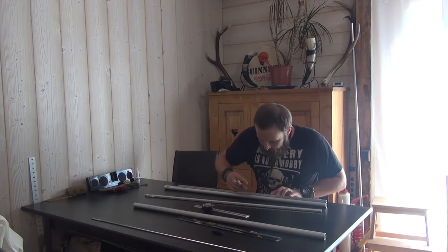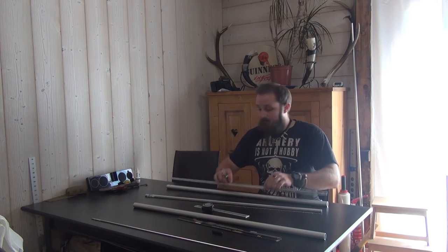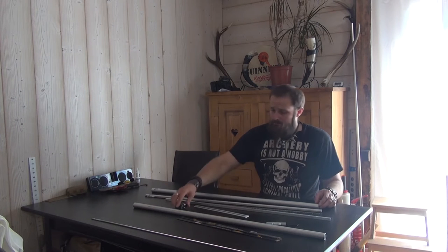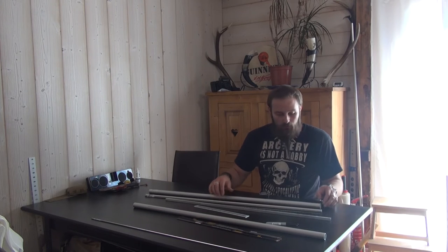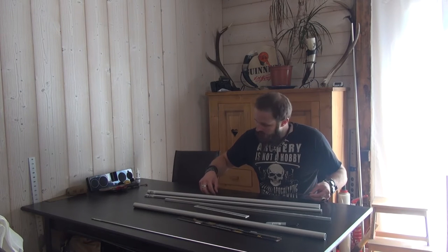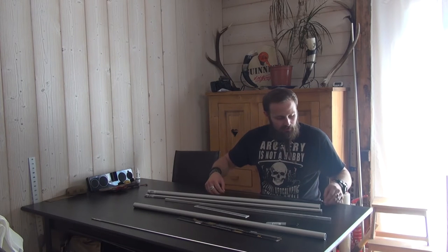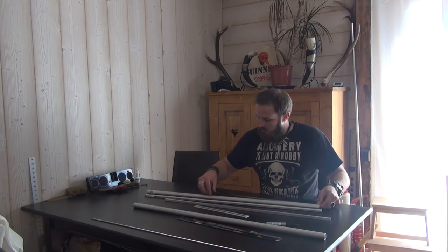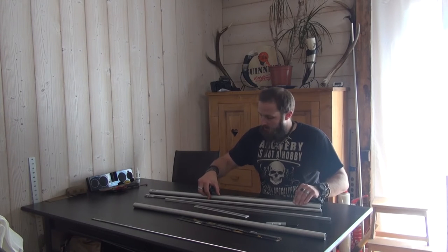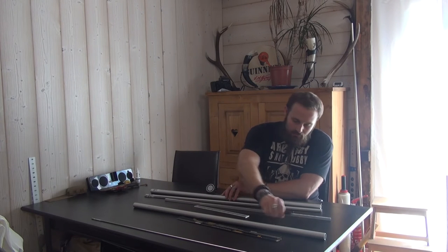You will see, it's not a very long thing to do. Last one I did, like 17 minutes to build it, and I will of course shorten the video to only the most important parts. Now the holes. Now that I have my center line, what I want to know is what is the length of the saw blade. Here it's 53 centimeters, so my end piece will be at least that. I will probably make it just 54 centimeters long, because when I cut stuff I will lose a bit of length, and always better to have more length than not enough.